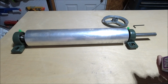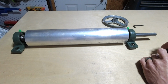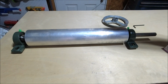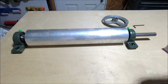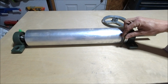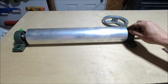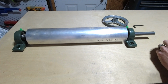And then to connect the shaft to the drum, we're going to drill 2 holes. I have these 3-inch long, 1/4 inch spring pins. We're going to drill 1 hole straight through the whole deal, through the pulley, through the block and through the shaft, and then put this beast in there, just like that, all the way down. It's a perfect fit for the drum. As you can see, it stands perfectly flush. Anyway, that's how we're going to start doing that.